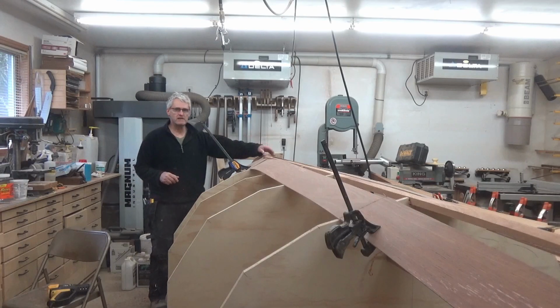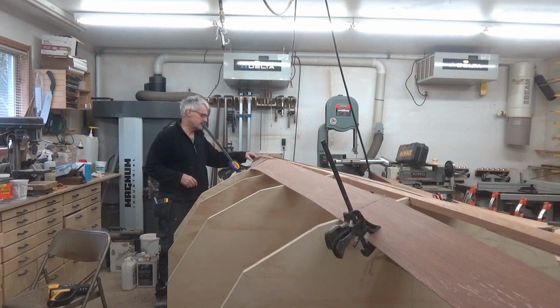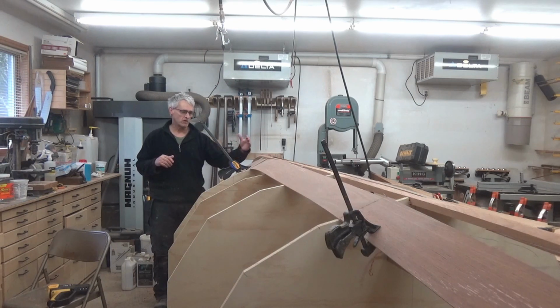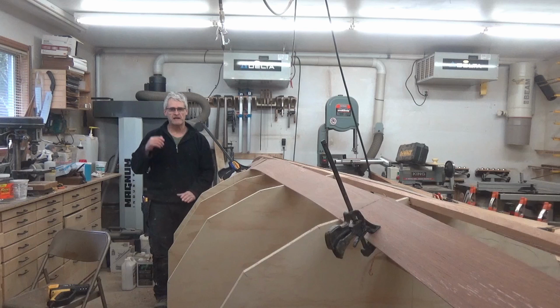Days shaping the keelson and the stems to accept planking. It's not perfect. We're going to just tidy it up as we go. But the next phase now is to make some patterns, or spiling in boat building terms, of the first, second, and third plank, or garboard first and a sheer gar or sheer strake.